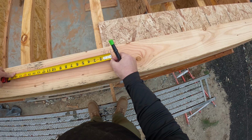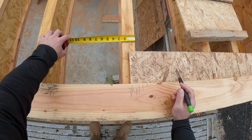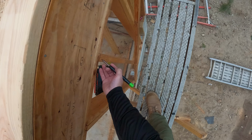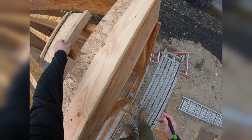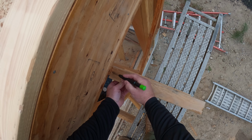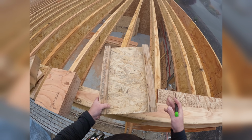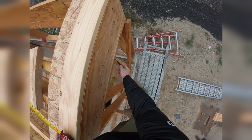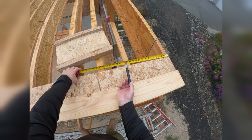But for each member, that's going to move, right? In this case, we have these, what are they? 2 5/16. So that's how we did this down below, is you have center of the stud, back 3/4. Where this joist is, center of the joist, back 1/2, and that would put the mark here. That keeps all of our load path aligned. This is where layout should be, about here. You notice we just went 2 feet, X back.